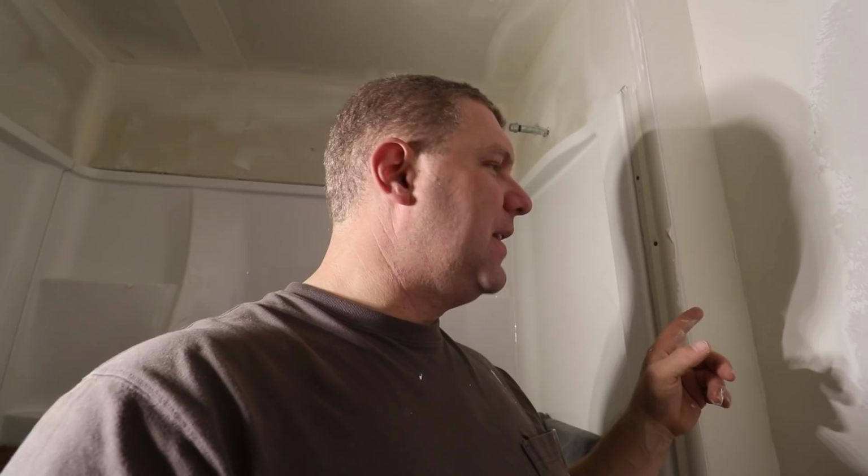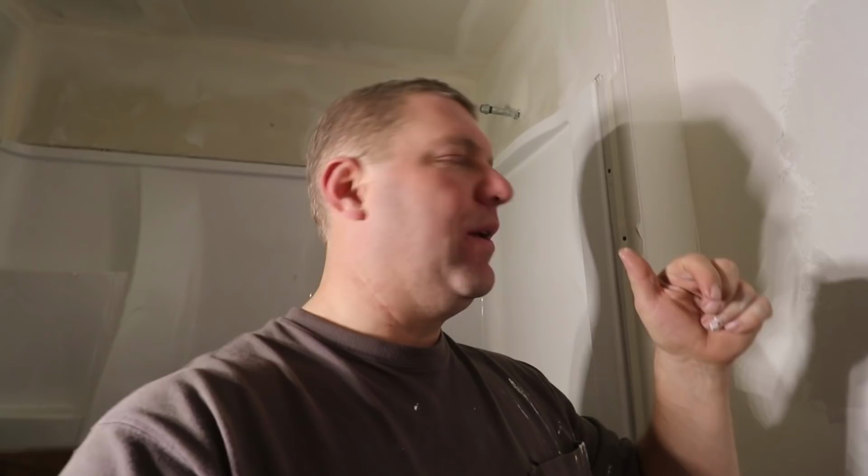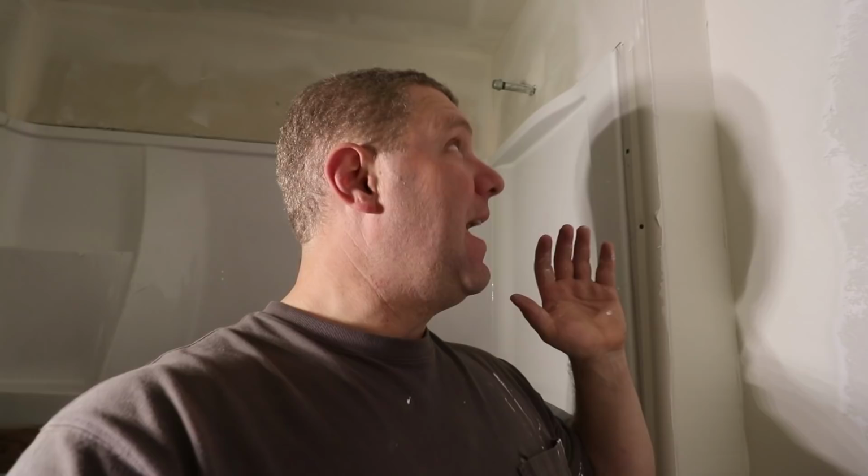And then it seems like the mud in the second bin is a little too thick. Some of the guys out there who do this for a living probably have like the perfect consistency. It seems like if it's too thick, you get a lot of separations where the mud actually wants to stick to the knife more than it wants to stick to its mud friend. I'm afraid to thin it though, because if you get it too thin, then it's like trying to put water on the wall, right? That sheetrock.